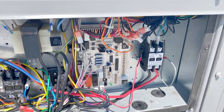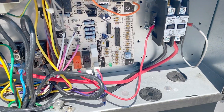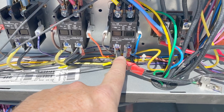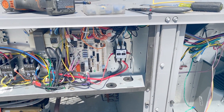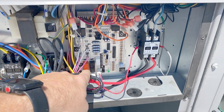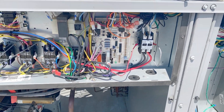We've got it all hooked up: indoor fan motor signal going to the coil, then from there to ground. We have our power taps coming in on this two-pole contactor going to the motor, with the other leg on line three. Last time I confirmed I was getting 24 volts from the board whenever I called for fan, so this should work.